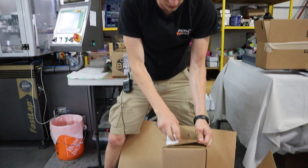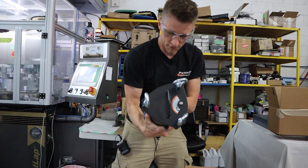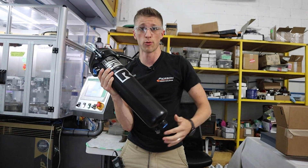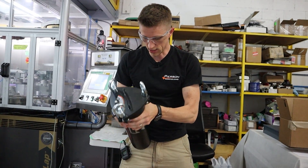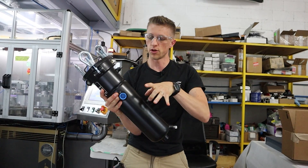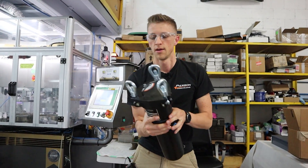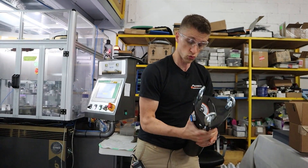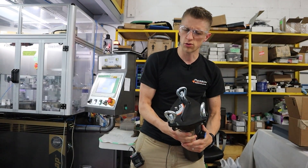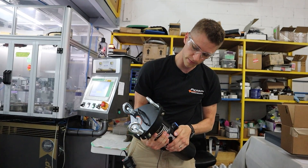This gauge is rated 500 psi — gorgeous. We have the same thing on the Nakamura; I'll show you in a second. It's already got ports for pressure gauges before and after. This is the split line where the bag filter goes down — it's got a drain, an outlet, an inlet, and an o-ring on the top. It's a really nice unit; I think it was around 300 to 500 dollars. Aaron will put part numbers of everything in the description.